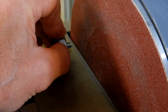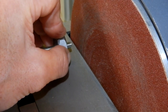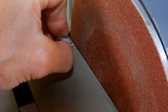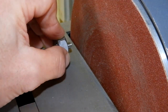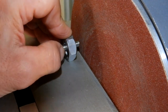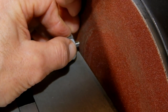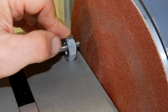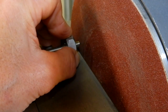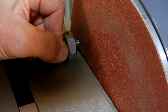This is a combination belt sander and then the disc here. And what that's going to do is keep you flat like this, instead of tipping the bolt, you'll be flat. Then you'll come over and kind of eye it up so that it's at a 90 degree, so that the spacing's the same between the disc and the die, and then you can also look straight on. And then when you grind it, you should come up with a fairly flat face.